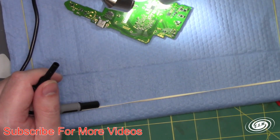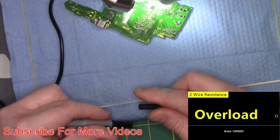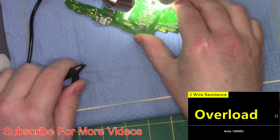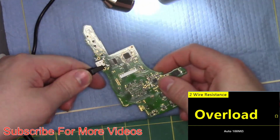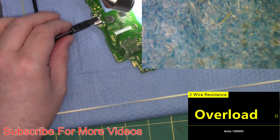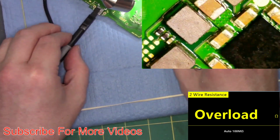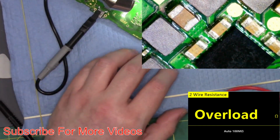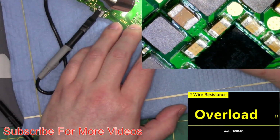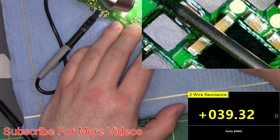Let me put mine back on 2-wire resistance. Put my meter up there, and we'll put that clip on the USB port. We'll bring up the microscope camera again, and we'll come back over to that chip right there. And if you measure the resistance of it, right there is 39 ohms.